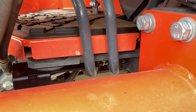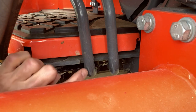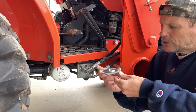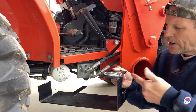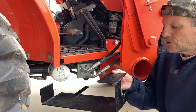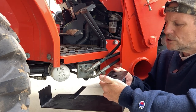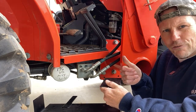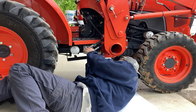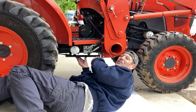The reason I moved the washer is because the brake pedals were actually hitting the guard. I want it up higher so there are no clearance issues with the brake pedals. That bolt sticks down under the floorboard — it has a small washer, then a big flat washer, then the lock washer, and then the nut. The first time I put it up with the nut on, it pushed the bracket down and was interfering with the brakes. That's the beauty of YouTube — you get to watch other people fail and then do it right the first time.